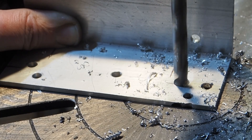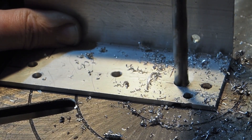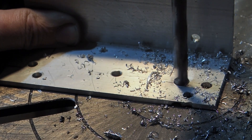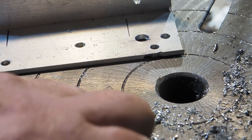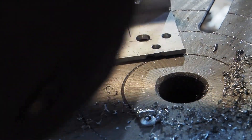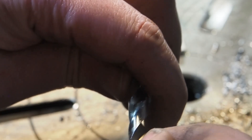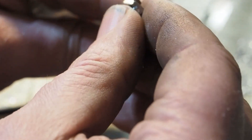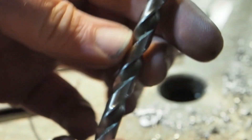It cuts. It cuts. It doesn't cut good. It didn't cut that. The culprit - you can see the chip welding right here on the back relief. So it might be beneficial for me to actually check the angles on the thing, because that is definitely rubbing. My back relief angle was no good.